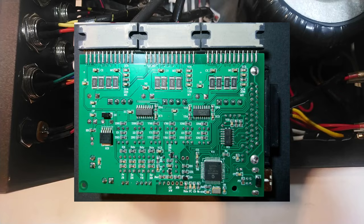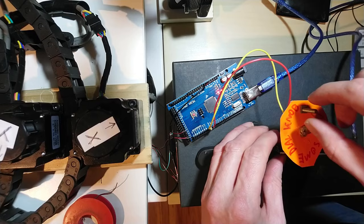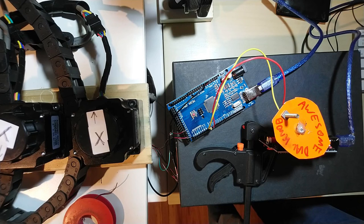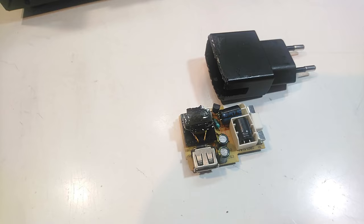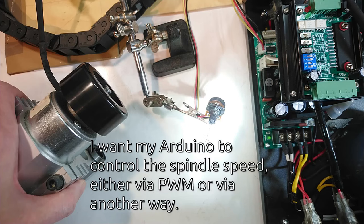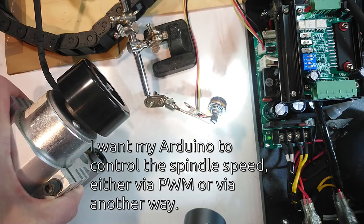I think the settings are fine as they are, so I will leave the board as is. As described in my first video, I will add Arduinos to my control box — one running GRBL and one handling a bunch of other jobs. My Arduinos will have their ground connected to the input ground and will be powered by their own supply in the form of an old small smartphone wall adapter. That brings me to my plans for the next video, where I want to find out whether I can improve the RPM control of the spindle. That's going to be interesting.